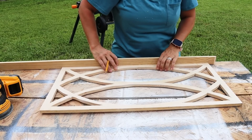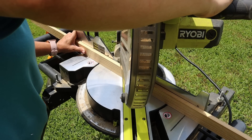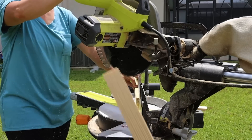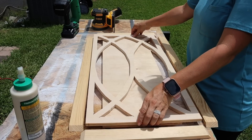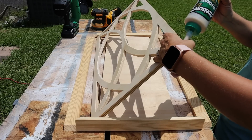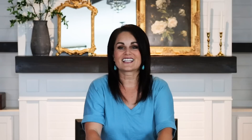I wanted to add a frame and I decided to do a miter frame. If you're not comfortable doing a miter frame yet, it really is super easy — I would encourage you to try, but you could do a butt joint frame as well. You start with a 45 degree cut. I always like to hold the piece of wood up to my actual frame and make the marks on there. Once you find one that works and your rectangle is square, you can repeat that on the other side, make two identical ones, then do that for the top and bottom. So really all it is is 45 degree cuts all the way around and you will have a mitered frame. Then I set a piece of plywood to lift it up because it was a one by two — I didn't want it to jut out too far. I lifted it up by half an inch using that scrap piece of plywood and then I took a nail gun and nailed that in all the way around.